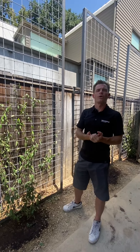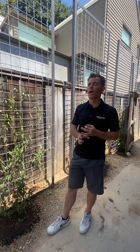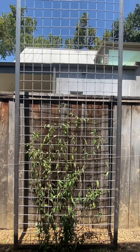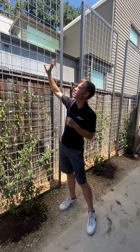One important detail to know whenever you're building above 6 feet at your property line is you want to make sure to check with your HOA, as well as any city code requirements. Here in the city of Austin, we have what we call a 4-5ths rule about anything above 6 feet. With these open hog panels at 4 by 4 inch, they meet that rule perfectly.